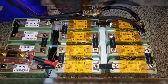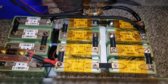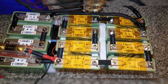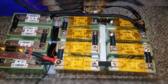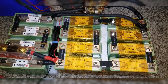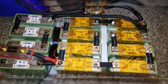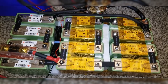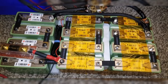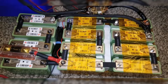These cells can pull up to about 1,780 watts at 25 degrees C — you can pull that kind of number in 10 seconds. The max current you can pull at 25 degrees C is 600 amps in 10 seconds. This battery can deliver that kind of power, and the internal resistance is 0.7 milliohms at 10 seconds.